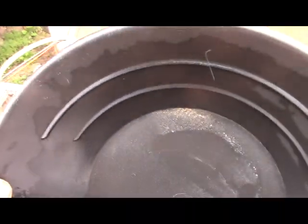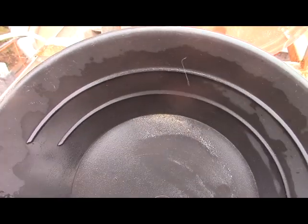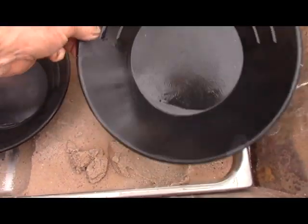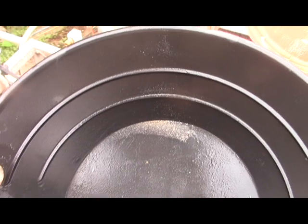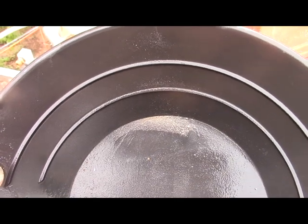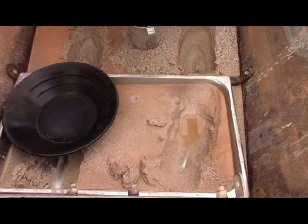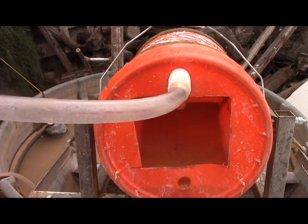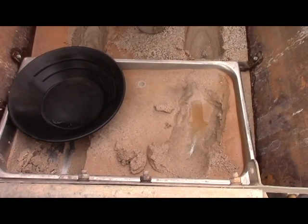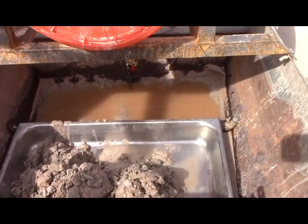This is from this side, and it has a fair amount of gold — roughly equivalent to the original head grade. And this is about the same. Now this is a dramatic improvement over the previous technique of just letting this thing sit the entire time. By recirculating that material back up in there, I do seem to be reducing the gold loading in this tray, which is a good thing. So based on that information, here is the new procedure.